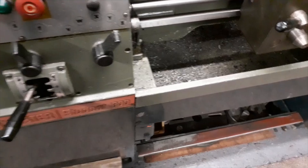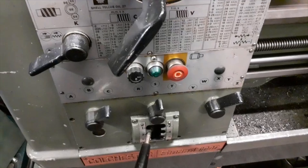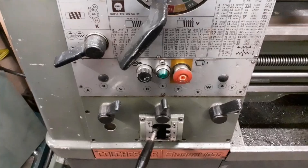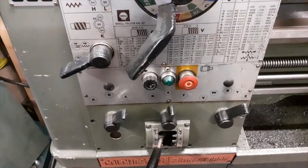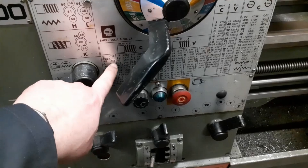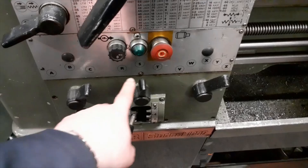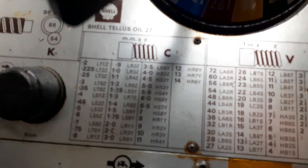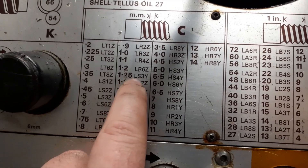On here is your selector — and besides that you've got your emergency stop button, which we also have on a pedal. That button is for your coolant pump, which is at the back. I don't tend to use it much as it makes a lot of mess, but it's there if I want to use it. In here you've got your selectors for all your different thread pitches — you look on the chart and select a position like A, B, or C and your numbers.